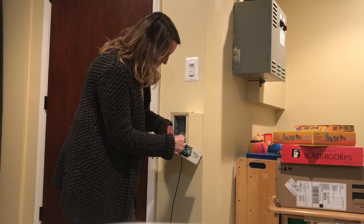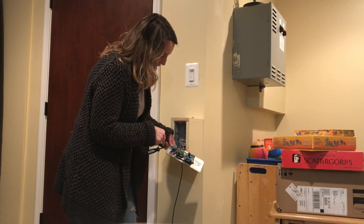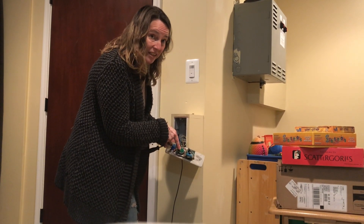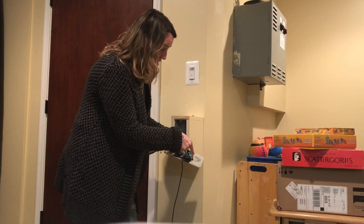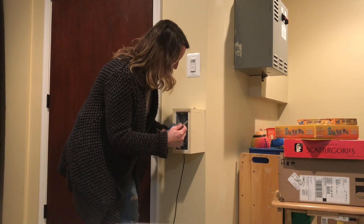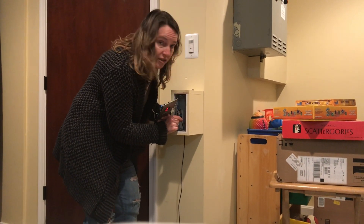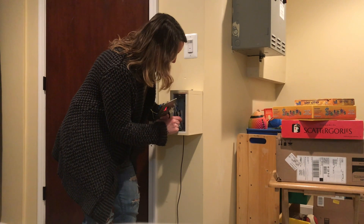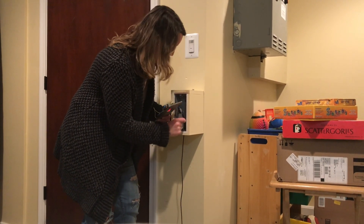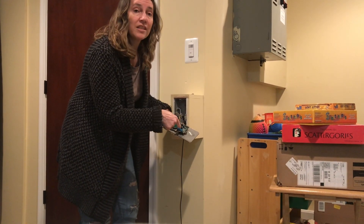All we have to do is add in a relay and add our wires to the button, so it makes the connection to the button and sets our elevator to go. And we have our own microprocessor that listens for the Alexa command. When this microprocessor hears the Alexa command, it tells the relay to switch the button, which presses the elevator.